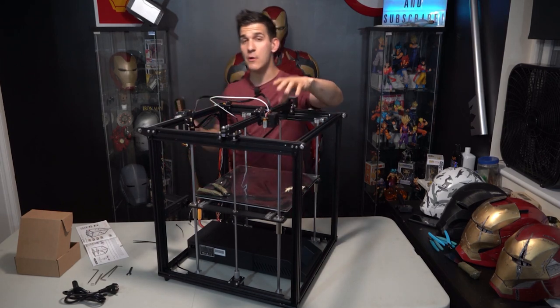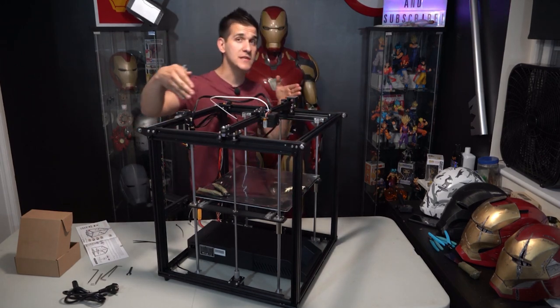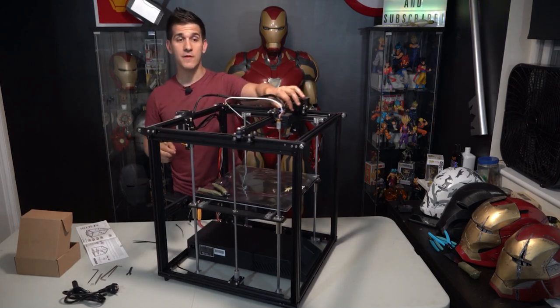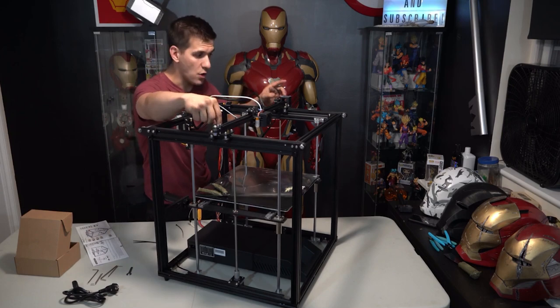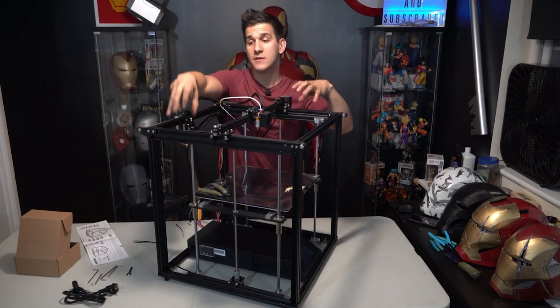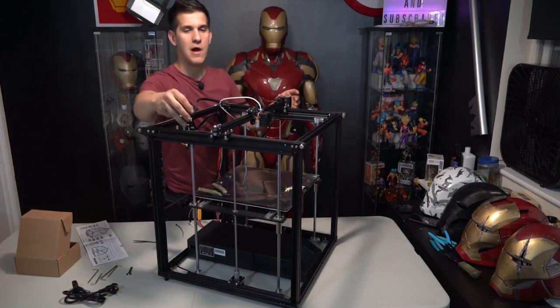With this moving good, I would go and do something similar to the whole top of the printer, the Y. So again, make sure you unplug your motor, and this will move freely. And there's eccentric nuts. There's one here, and one here. That's what's actually holding this top rail to the whole frame. Now, you really won't have too much of a problem with this one.